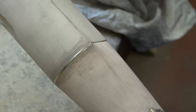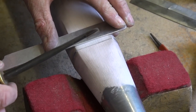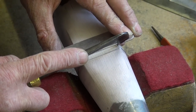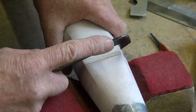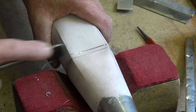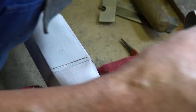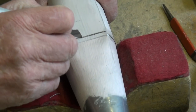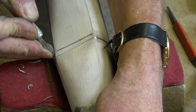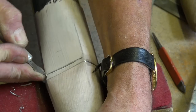I want to show you now how we put the mouth section in, or the voices. Just a little like the other — I can adjust it afterwards. It's curious that Harrison in Durham, they take the mouths out in the flat before the pipes really open, and I'm not a big fan of it. I don't think it's a good method at all. I can see why they might want to do that. As George has just shown, he's actually aligned the foot to the body by aligning the lower lip and the upper lip together.